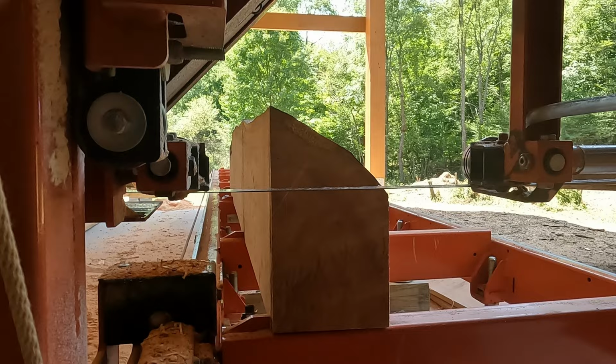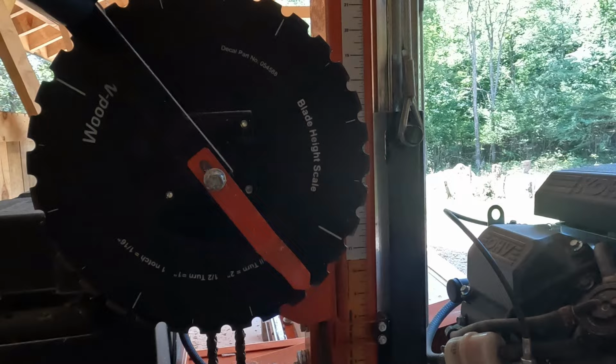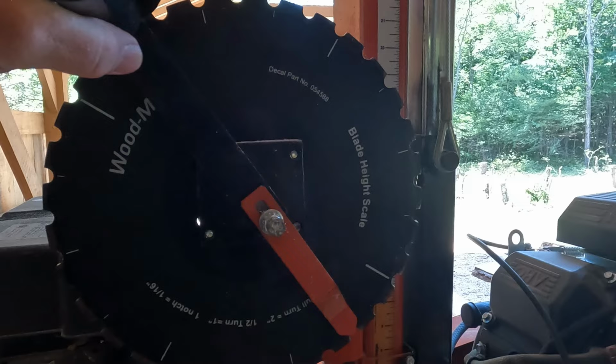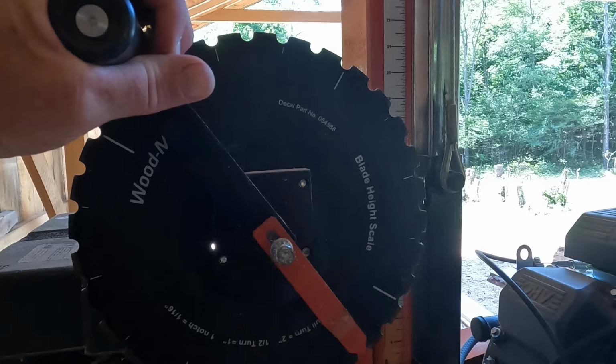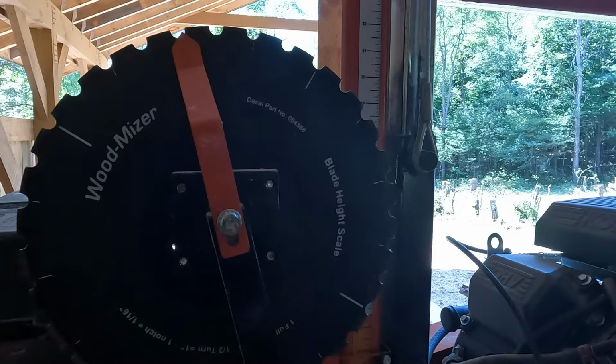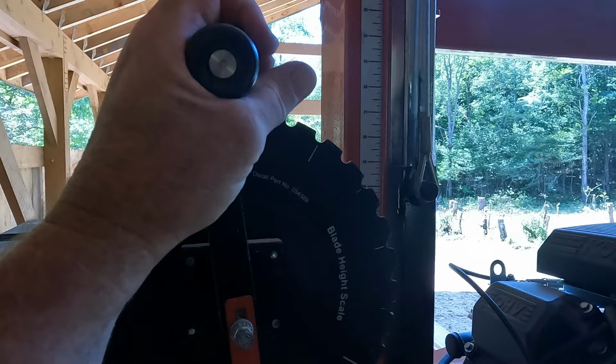So we'll come back up here. I'm at 7 1/8. I'll probably just cut those into 1-inch boards. Hopefully this won't be too wobbly. So I want to come up 1 inch, which is half a rotation on the LT15. So up 1 inch, whoops, it's going down. So up 1 inch, and then account for the kerf of the saw, 1/8. And then I'll do it again. I have enough room for another. 1 inch and 1/8.